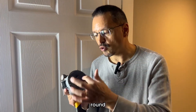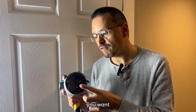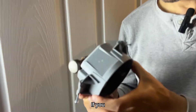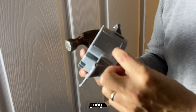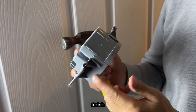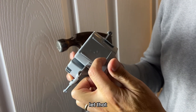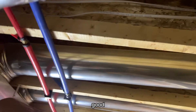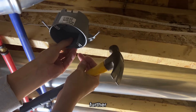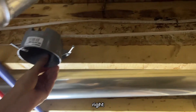Step one: you're simply going to install your round electrical boxes for light fixtures in the ceiling, wherever you want them, as many as you want. This is an easy nail-in device, super easy to use. If you look at the side, there will be a depth gauge. You want it to be proud or stick a little further out of your framing, just in case somebody wants to finish it off with drywall or some other ceiling in the future. Right here is a good location for this dark corner of the basement. You install it so it sticks further than the floor joist.